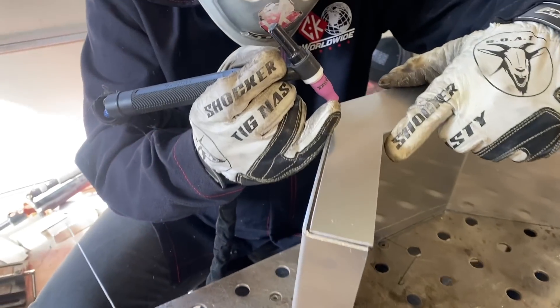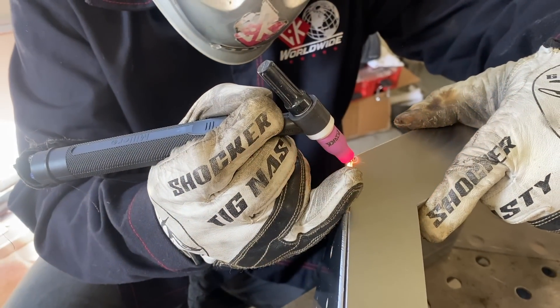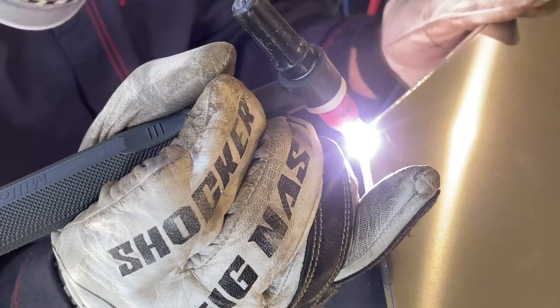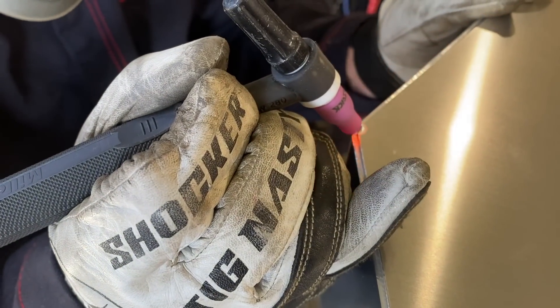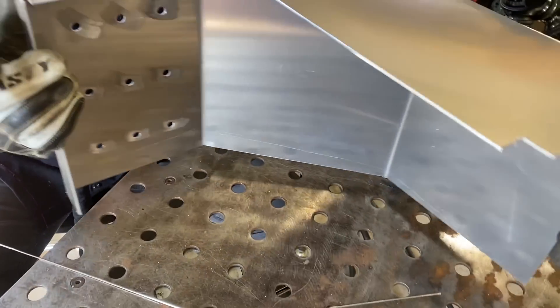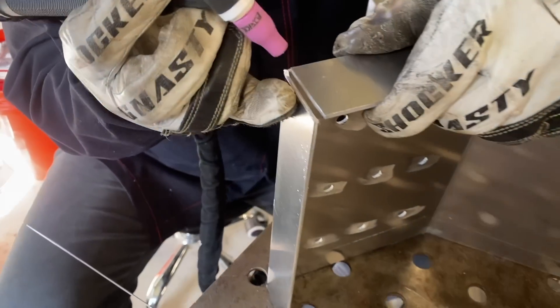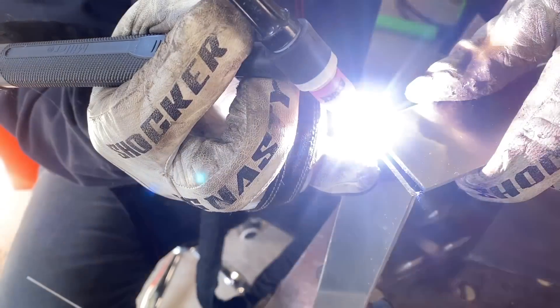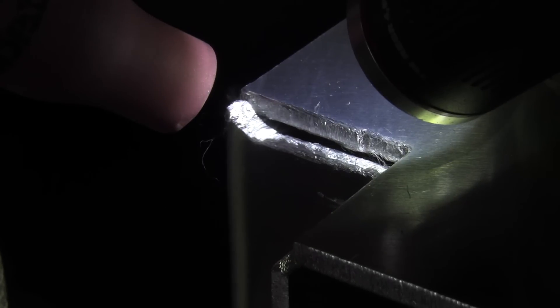Speaking of tack welding, sometimes this is called burst tack or flash tacking. You need more amperage than what it usually takes to weld. Brad already has the machine set at higher amperage because it requires that for pulsing with the foot pedal. This is 090 thickness and normally that would only require about 90 to 100 amps, but Brad set the amperage to roughly twice that for these burst tacks and for pulsing with the pedal. Coming up is a real close-up shot of flash tacking one of these corners with that little point - shown first in real time and then slowed to half speed - pointing the tip of the electrode right at the top of that little point, lighting up, and quickly giving it a blast of amperage to fuse those two members together into a really quick small tack.